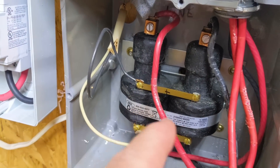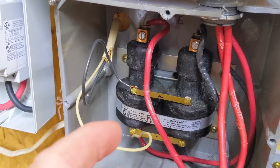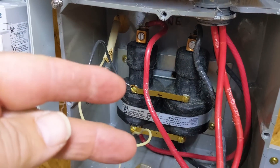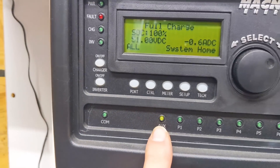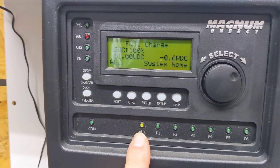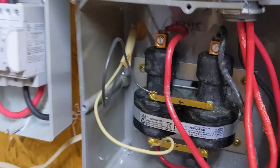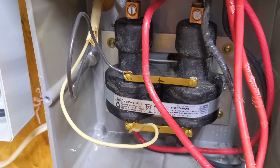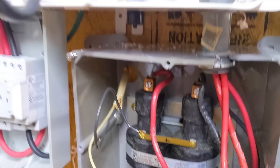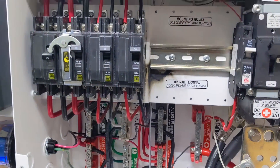This is a mercury switch and contactor — that's not ideal. It's got 48 volts to it, controlled by the auxiliary on the Magnum controller. It uses frequency shifting to control whether it's on or off, so it's basically an on/off contactor taking the AC output from the SolarEdge and charging the batteries. It's a little bit brutal.